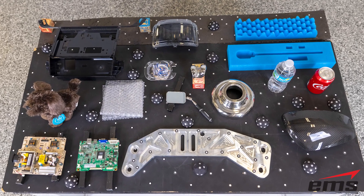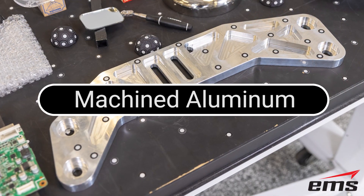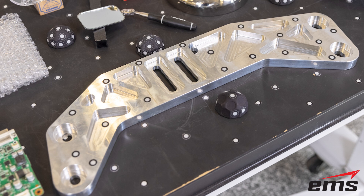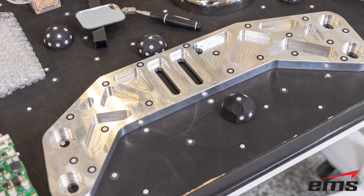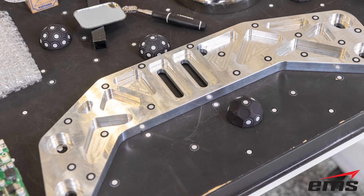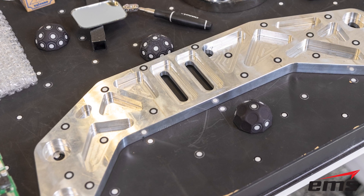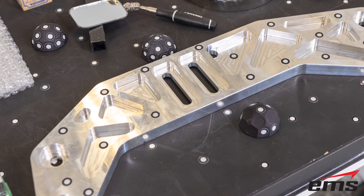The surface types in this challenge are as follows. Machined aluminum — specifically very shiny aluminum with sharp corners. Why sharp corners? Because 3D scanners have a real issue trying to pick up the surface in the corner. The scanner light tends to scatter all over the place in the corners and you can get some really rough or missing information in those corners.